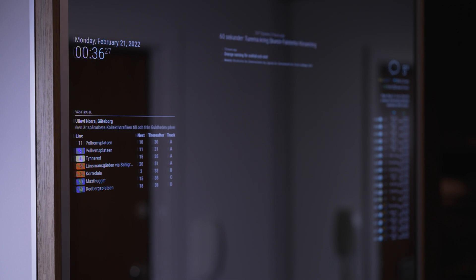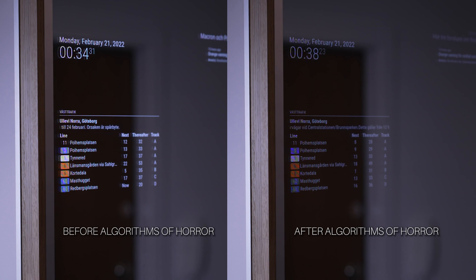There is, however, a big elephant in the room here. A big downside to using an OLED for this type of application, and that is the risk of burn-in. Since the mirror displays a lot of static text, it becomes a poison for the OLED. LG has some protection algorithms to prevent burn-in, and they are horribly intrusive in every sense. There are different things triggering these algorithms, but they all result in the screen getting dimmed to protect the diodes. Some of these can be turned off with a special service remote, and others cannot. The algorithms can, for example, result in lowered brightness within a few minutes of an image staying static. And they aren't smart enough to know what's going on on the screen. So, even if you display a totally black picture — which essentially means all pixels are off on an OLED — the TV still sees this as a static image and lowers the brightness until something major happens on screen.